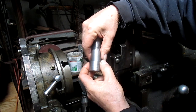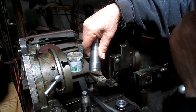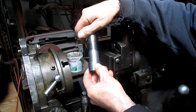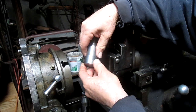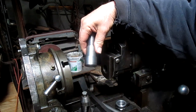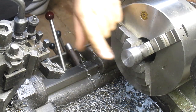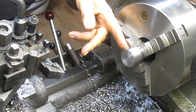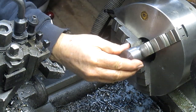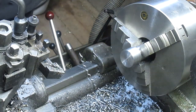I'm thinking maybe once we get it down we'll take this diameter down just a little bit. We need to cut this much off, and probably the easiest way is to put it in the lathe. We could put it in the saw and try to saw it but there's nothing to grab onto. So we'll put it in the lathe and start trimming - we need 180 thousandths of a lip there. I want to give myself just a little bit of room because afterwards I'm going to come in and take a couple of thousandths off of that diameter.